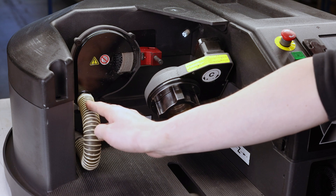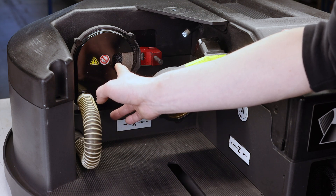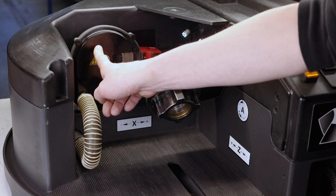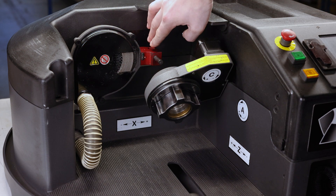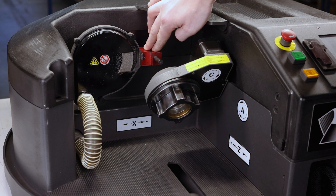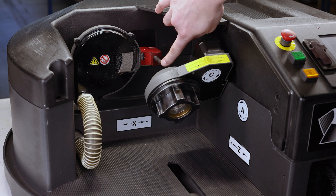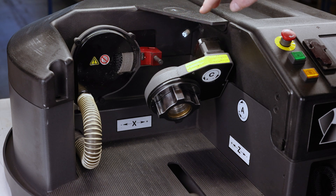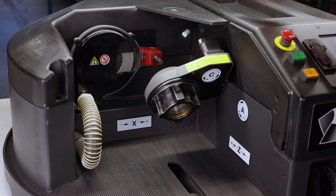On the X axis you have your grind wheel, a home brush option, and your grind wheel guard. Over here you have a fiber optic detection block with two sensors mounted underneath it. One detects the type of drill that's been inserted, and the other detects the cutting edge. This fiber optic beam is how it calculates certain measurements like the web thickness and all that of the drill bit.